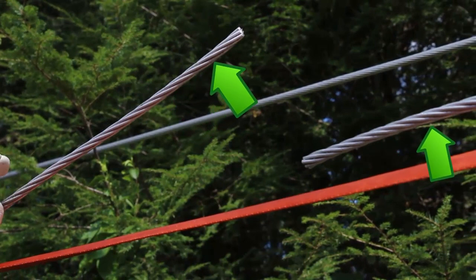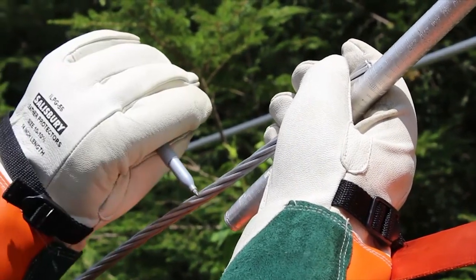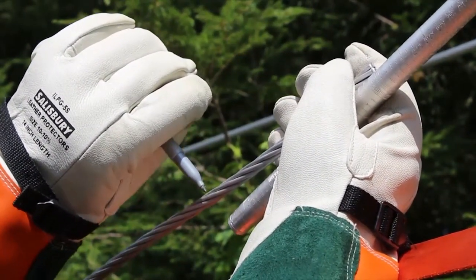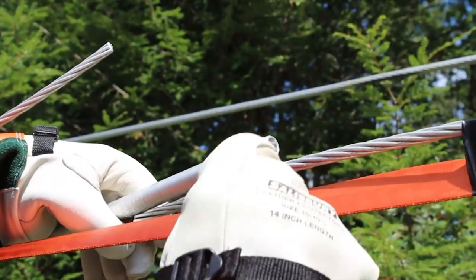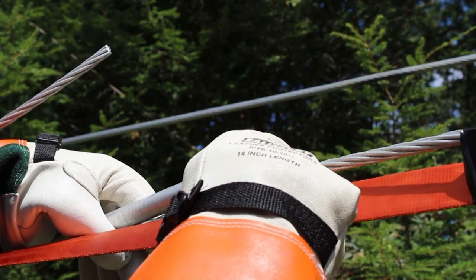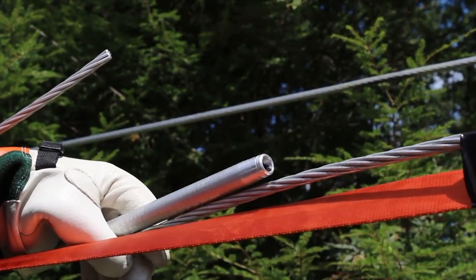The splice, however, does not require wire brushing. Next, line up the conductor along the splice to the center point and mark the conductor. This step ensures the conductor is inserted completely during installation. Now repeat the step on the other conductor. With the conductor marked and wire brushed, it is now time to insert the conductor.